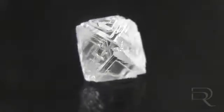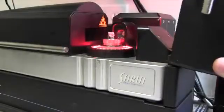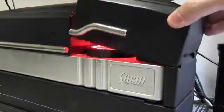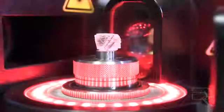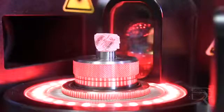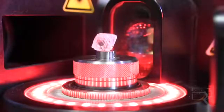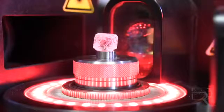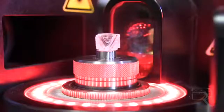The diamond crystal is first placed on the sarin machine. The sarin machine is used throughout the diamond industry for the mapping of both rough and polished material. It provides the diamond cutter with the visuals needed to determine the cutting pattern to yield the largest diamond while at the same time achieving the highest clarity.